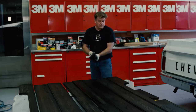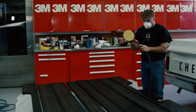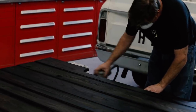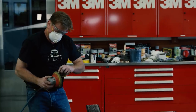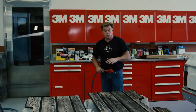I've got a second coat of color on there. I'm going to go ahead and sand that one more time and see if we need more color or just leave it the way it is. To me, this is just like creating a piece of artwork — every piece of wood is its own piece of artwork. I love what this is looking like right now. But I think what I'm going to do is add one real thin layer of this ebony stain just to even the color up a little more over the boards, and then we can put a sealer on that.